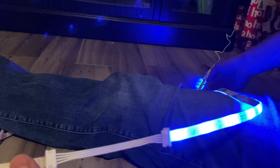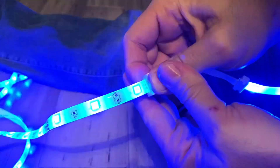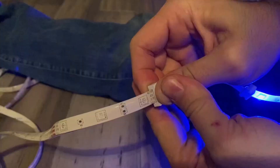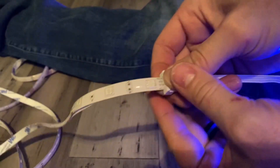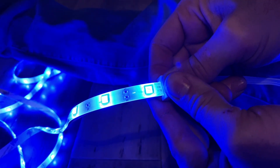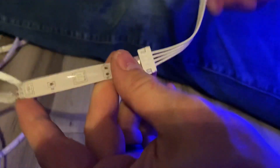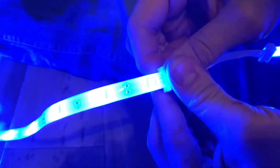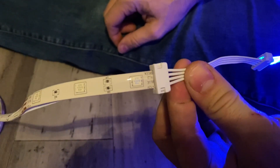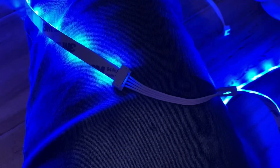This is kind of what I thought — both clamps clamped down hard, I'm set up for my 90 degrees, and I was like what's going on? I've got power here obviously because this goes straight into the wall. When I was mashing around on it, watch this — if I squeeze this, the light comes on. So the clamps are fine but there's no other reliable way to do it. I always recommend: anytime you cut these lights, scrape the silicone off and solder your wires together. These clip connectors are only as good as they are, which as you can see is not great.